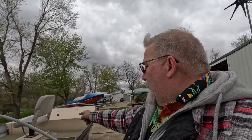And there again, I just used nothing but quarter 20s to hold it down. And you guys might be thinking, my God, quarter 20s, you should have used like 5/16ths or 3/8ths. No, absolutely not. Ten of these is plenty strong for this seat. Four in the middle there is plenty strong to hold that seat.